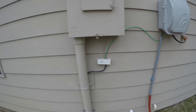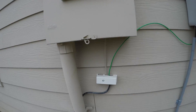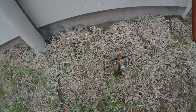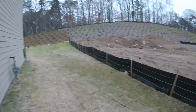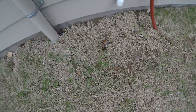Here's the service entrance grounding block, and yes, that was here when I got here. My ground cable goes down, I threw it under the grass to this ground rod, which is eight feet down. In Cherokee County that is quite a feat — we have a few rocks, you can see rocks in the pictures.